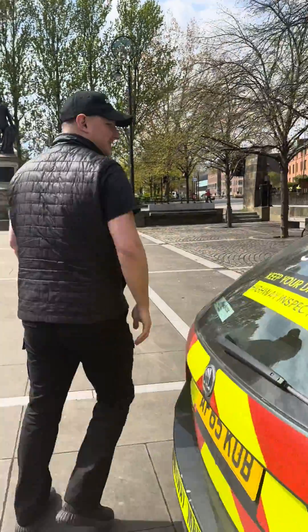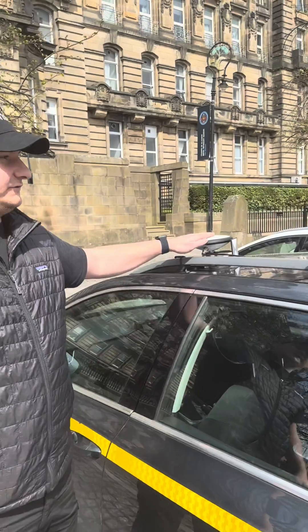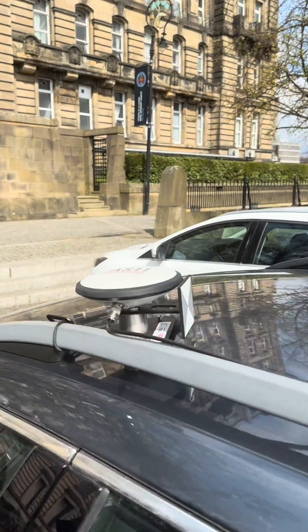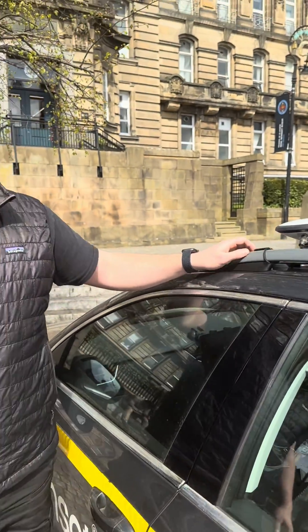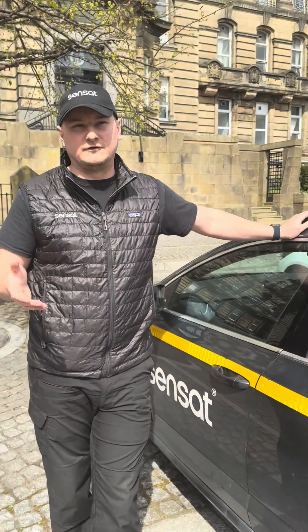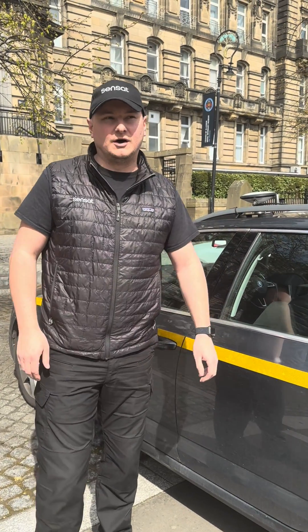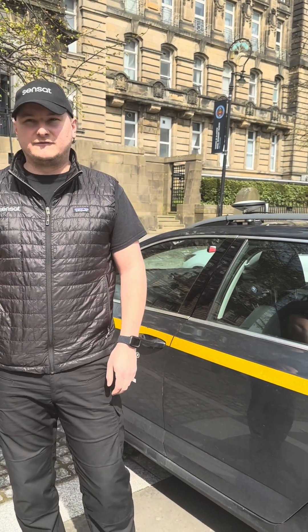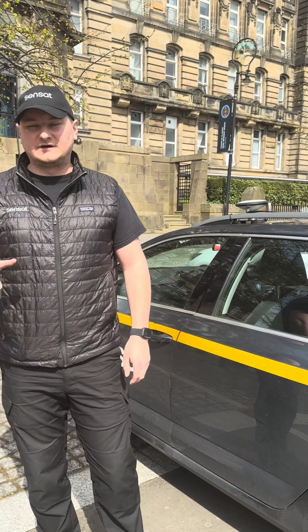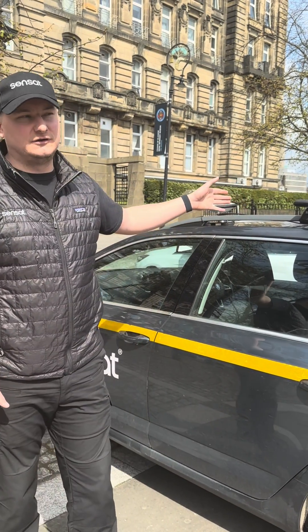Follow me around. Here we've got the second GNSS unit, which we use during our cityscape data capture projects. This gives us as many satellites as we can, because as we're going through high-featured buildings we lose satellites quite often. In open skies we'll have around 33 satellites, but going through the city that can be reduced to eight, sometimes zero — so we track that with the second GNSS unit.